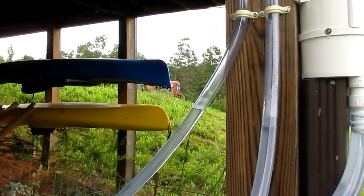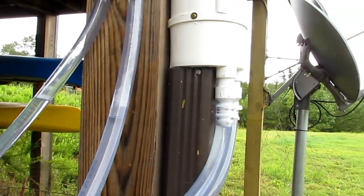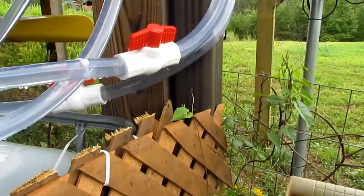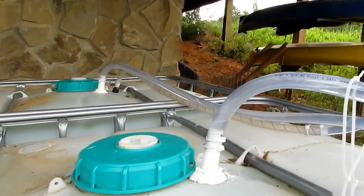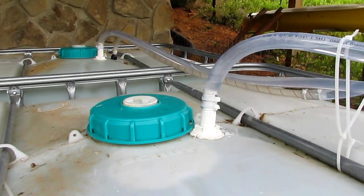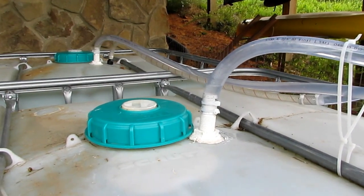As you can see, the water in the air bleeder is exactly the height of the water in the diverter, so now the water in the diverter will go down the downspout as opposed to into the top of the tank. We now have water storage for about 550 gallons of water at home, regardless of what's happening with the electric or with the well pump.